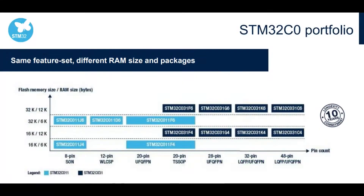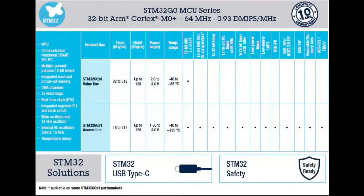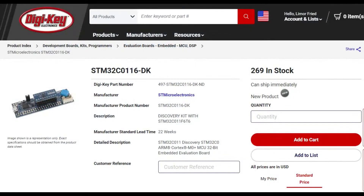For the G0: the G0 X1 does have native USB and USB PD, which is neat — I might feature this in a future Eye on NPI. It's cool that they built in a PD peripheral so if you have a device powered off USB-C but want 9 or 12 volts, it can do that negotiation for you without a separate chip, saving more money. There's also a nice dev kit in stock.